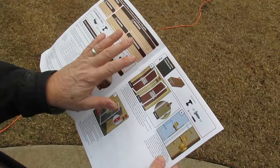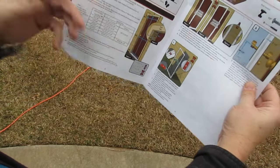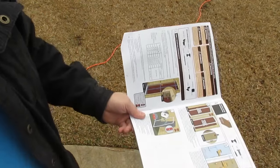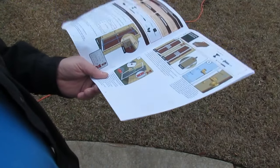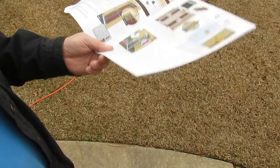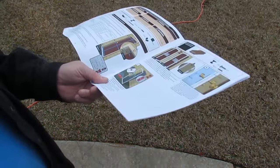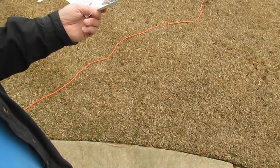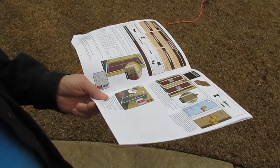Before you buy one of these, you have to make sure you have the right size. You've got to measure the width and the height of your door. My door, for example, is 36 by 80, so I bought a 36 by 80 door. You also have to know which way you want the door to open — whether you want a left-hand or right-hand door. To determine which hand you need, put your back up against the hinge side of the door frame, and whichever way the door opens — whichever hand it opens toward — that's the hand of the door. If it opens to your left, it's a left-hand door; if it opens to your right, it's a right-hand door.